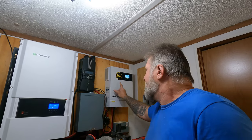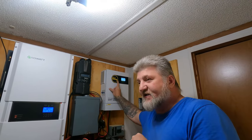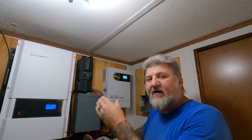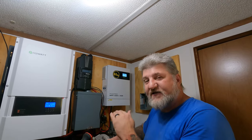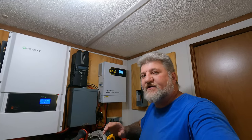What I really like about this is whenever the sun goes down and it doesn't read at least 120 volts, this thing will completely power down — it's not sitting here all night long drawing power off your system. Once it doesn't see 120 volts, it'll shut off. And the next morning when the sun hits the panels again and it sees 120 volts, it'll basically turn itself right back on.